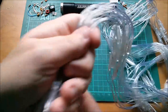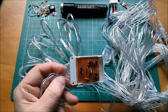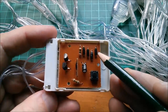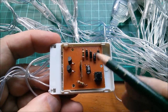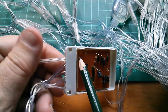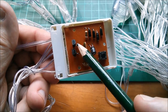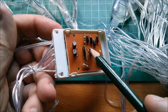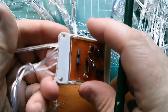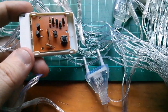I definitely don't want to plug this into the mains as-is. I think I can see how it works: rectified mains input — if we say AC USA mains at around 100-something volts — comes onto the board and also goes off on two lines down to the LED matrix. Three other wires are there, and the transistors driven by signals from the chip pull these lines down to create a flashing pattern. I'm wondering whether I could put DC on this directly — maybe 80 volts DC — since it looks like it's immediately rectified.